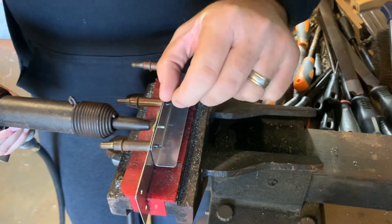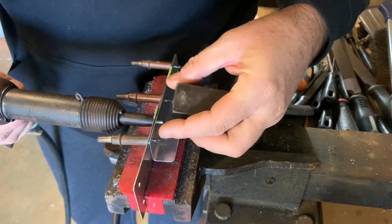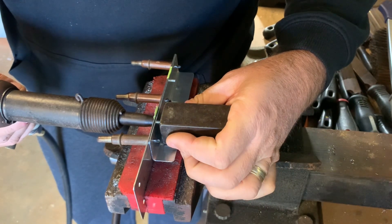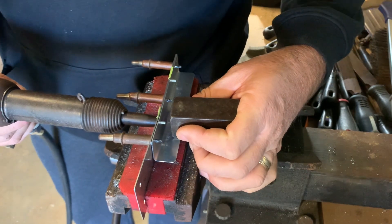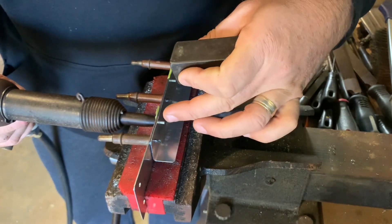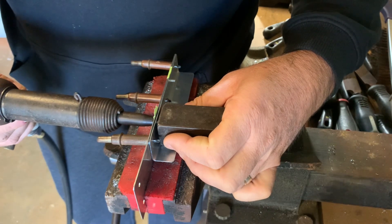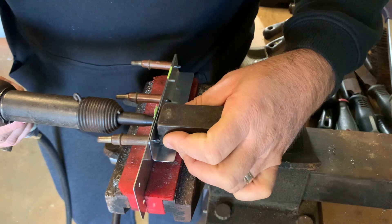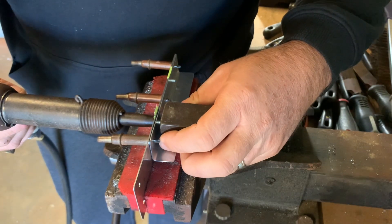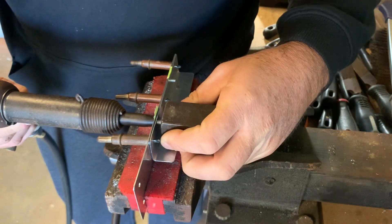If there's a gap between the skins, the rivet will swell up between them and hold them apart, and we don't want that. Once we're happy it's all seated and square, the dolly driver gets onto the rivet tail and gets ready to rivet. It's important to have equal pressure between the two. If the gun driver pushes too much you end up with a big woop in the skin that'll stay there once it's all riveted up. Same with the rivet tail - if the dolly driver pushes too hard the rivet will swell with the head sitting proud of the skin, and you'll have to replace it. So equal pressure. Once the dolly driver is happy and it's all square and ready, you call out 'rivet' and you rivet away.